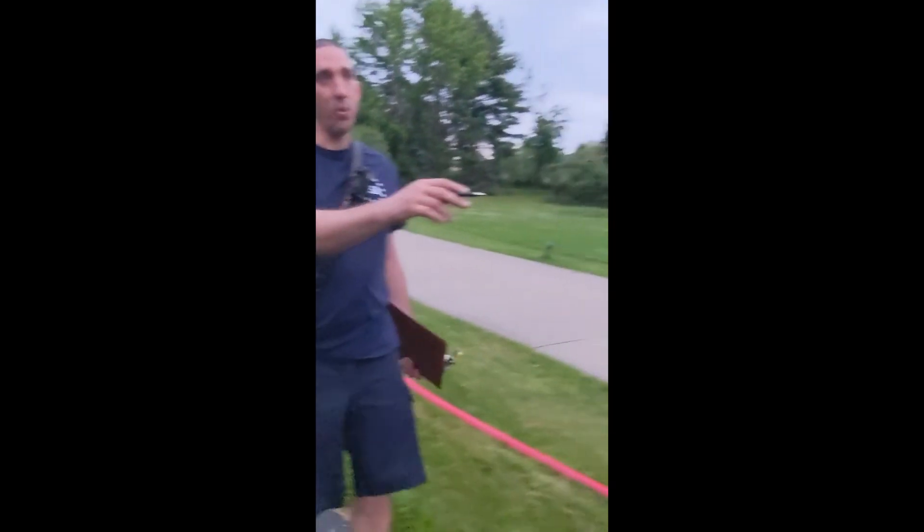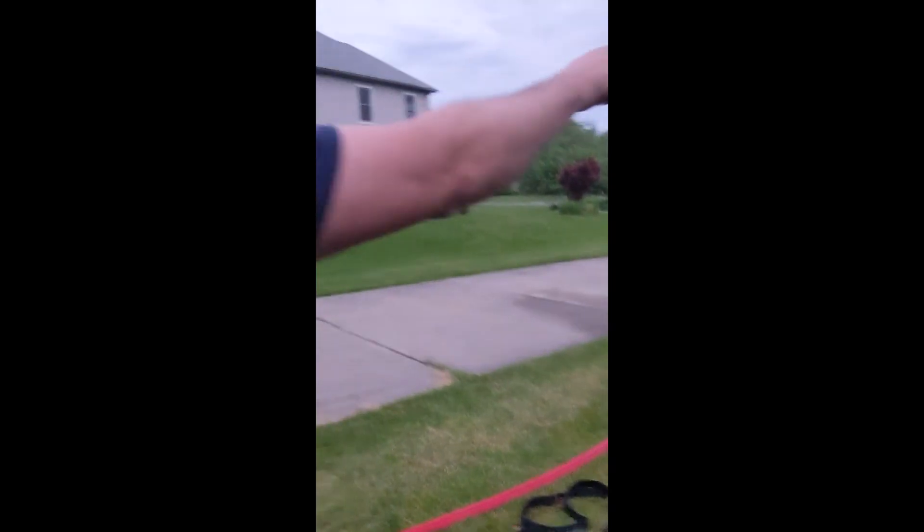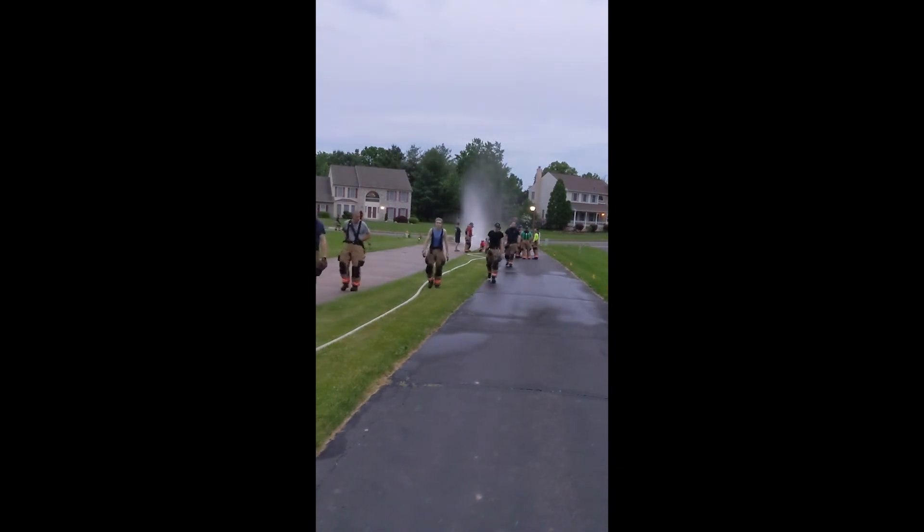At this last break, we took our 100-foot inch and three-quarter rack, extended it on, then went out another 100 feet, and that brought us out to 800 feet. At 800 feet, we were at 240 pump discharge, 80 PSI at the nozzle, 161 GPM with the fog tip, and 182 GPM with the internal slug.